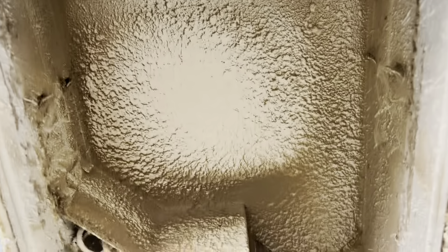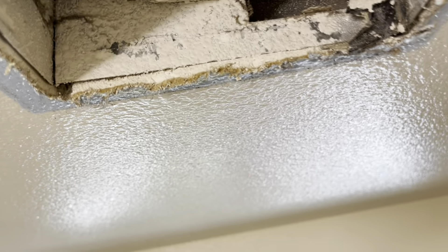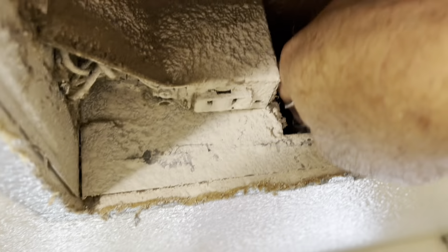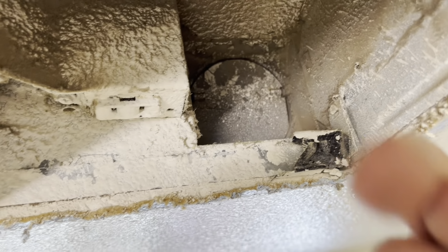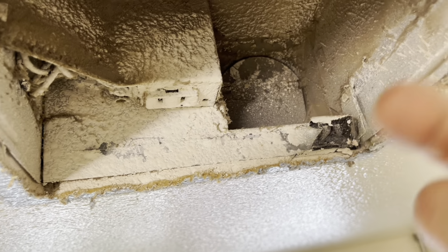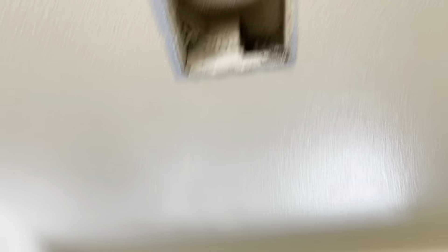So up in here, while it is a little bit dirty, it is in good shape. There's where the air goes out — this baffle seems to be working correctly. We want this to open and close: open to push air out, but on a windy day we don't want air coming back in. It's set up like a one-way valve — it'll only let air go out and won't let air in. So we'll just clean that up a touch and then talk about putting our new parts in.